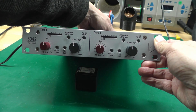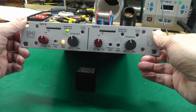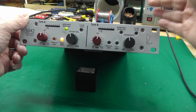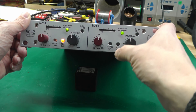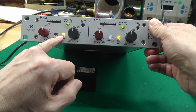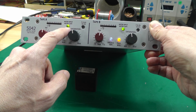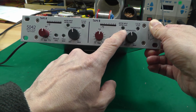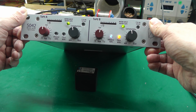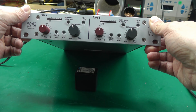Let me turn it off and on again. Maybe it only flickers with an input signal of a certain level — I don't have any analog input into it right now. Wait — that bus light seemed to flicker, and the tape meter input just went out. There it is — the flickering. So probably the lights behind all these push buttons are flickering as well.